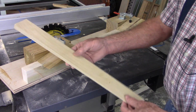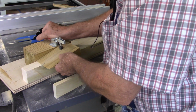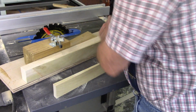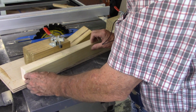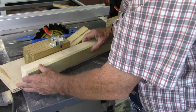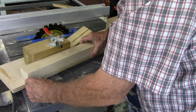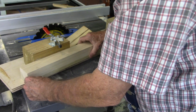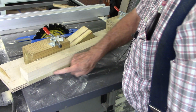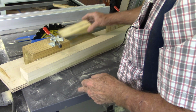Okay, I cut off my first little wedge here. Now what I'll do is undog it. I'll put that wedge back on it, just how it came off. Then I'll flip it over on its side. Make sure that wedge is just right. Okay, so now my wedge is under here. It's going to be tapered on 2 sides, the inside corners.